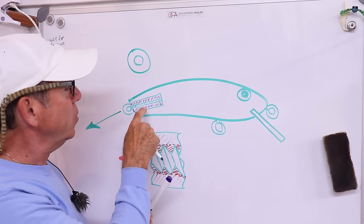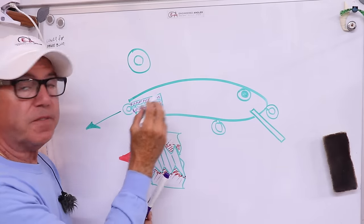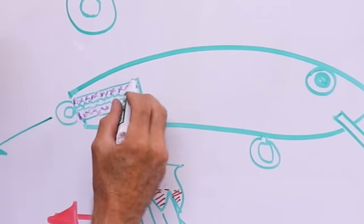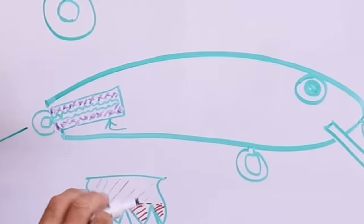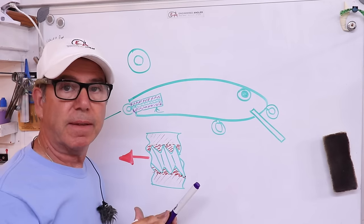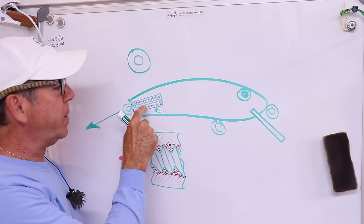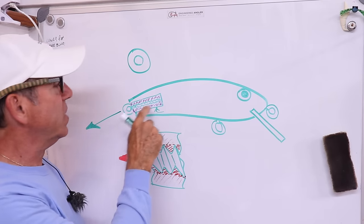And assuming that the glue is going to be slightly stronger than the casting epoxy, the shear failure is going to be along the outside of this hole you drill, and it's going to be between the glue and the casting resin. And by making it larger, you have much larger area and you can increase that strength. Now, this is assuming that you mix your two-part epoxy just right and that you fill this cavity in completely so it doesn't have any voids.